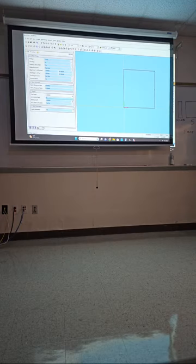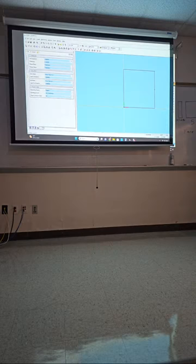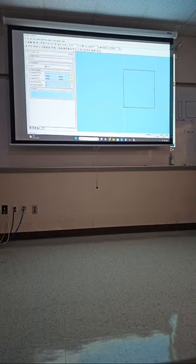Okay, let's make the math easy for everyone. If we do 0.050, what does that mean? How many passes is it going to do? Two passes. That's right. 2 times 50 is 100. And then Links for right now is going to stay the same. So summary, General: two things, operation name and tool ID, a 3-inch face mill.